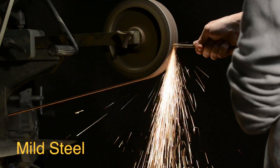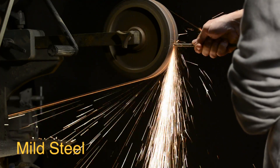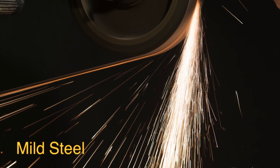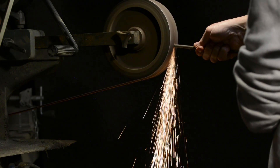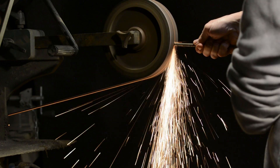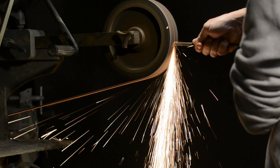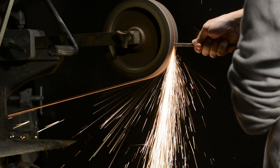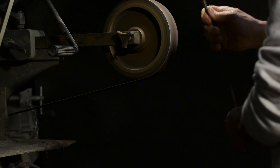Let's start with the most commonly available steel on the planet. This is low carbon, simple steel — the sort of stuff used for rebar, I-beams, etc. You'll see it throws long sparks, sort of like little meteorites. If you see steel referred to as mild steel, welding steel, structural steel, or A36, these are terms of varying specificity that all describe the same general category of steels, all of which are too low in carbon to be used for knife making. Because they can't be hardened — if you make a knife out of low carbon steel, the edge will get dull in a heartbeat.